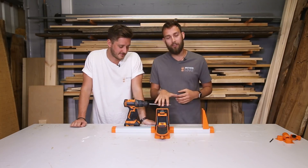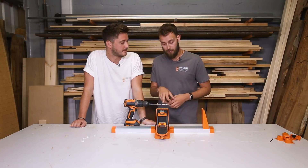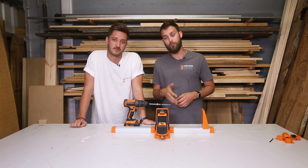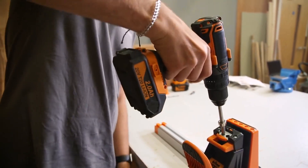The T6 is primarily suited to any project where you're doing a large number of pocket holes or you're doing repeated holes one after the other. The speed drive technology allows you to leave the drill and the drill bit in place, so you save a lot of time without having to remove the drill and drill bit over and over again.